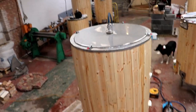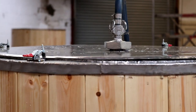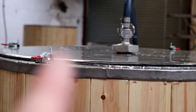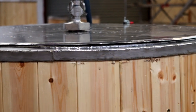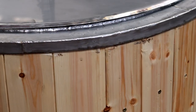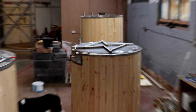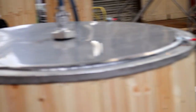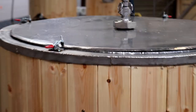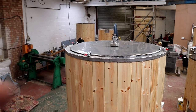I've given her a test run. Gemma's just fetching her jug so we can put some caustic in there. The lid is adequate but it's not great — between the clips it raises up slightly, and we do get a little bit of water coming out. Can you see the little bit of water squirting out? So I've got an idea: I think I'm going to revert back to a style where instead of angle iron I make something out of box section with little brackets that they clip into, so all of them can tighten the lids down. But maybe not immediately — this will do for now.